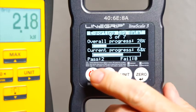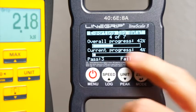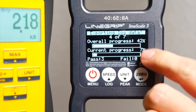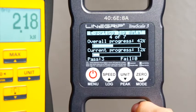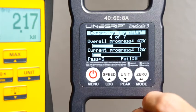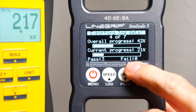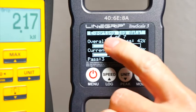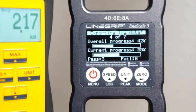I have a dual USB stick here with a standard USB-A on one side and a micro USB on the other. When detecting a USB stick in the port, the Linescale will automatically change to file transfer mode and upload all stored logs to the USB drive. All log files are then verified on the drive and will show a pass if saving was good, or a fail if the file failed to save. If you have a high-quality USB drive, you should actually always see zero failures.